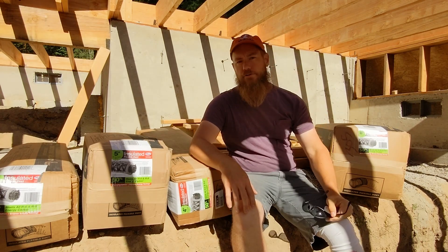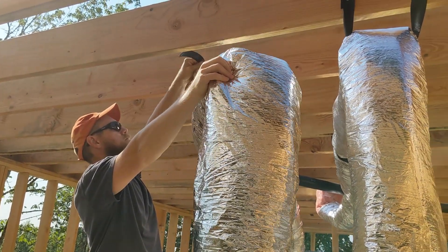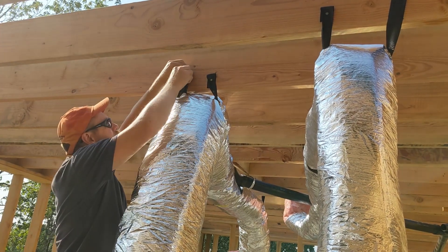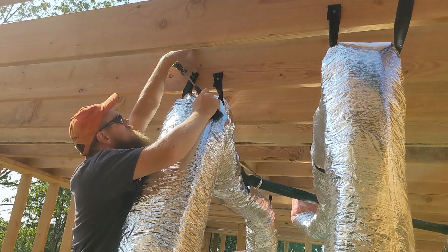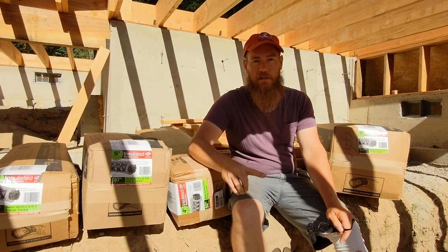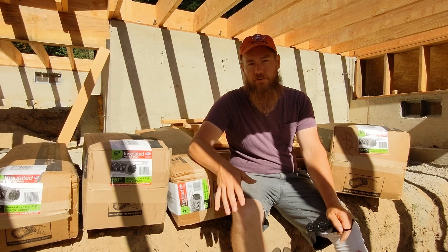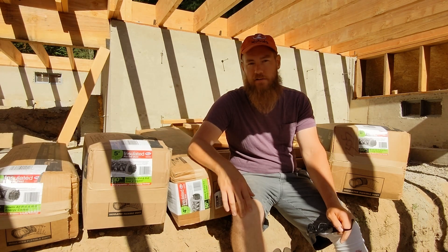The major reason, other than cost, that we chose to go with flex duct — and I prefer flex duct for all your branch lines — is just that it doesn't carry noise. We've had a couple of homes that had metal duct installed throughout, with more expensive versions supposed to deaden sound transfer. But in the last house we had, we were still able to hear our kids through branch lines that went back to the main trunk line and then to their branch lines — about 100 feet of twists and turns of duct work. We were still able to hear them through the ducts, and they would hear each other and it would keep them up. We just don't like that aspect. They're very noisy.